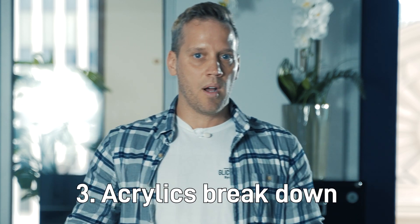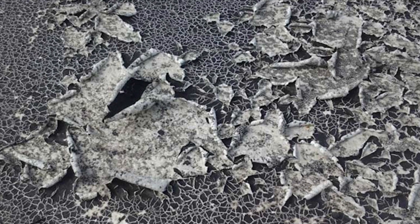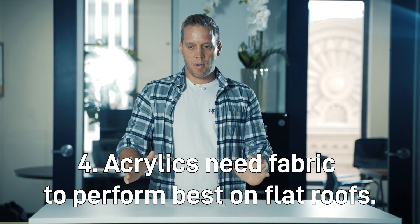Even on a large flat roof that's doing semi-well, whenever you look at your drains, they refill and water starts to back up. Now you have water sitting on the edge of the acrylic — wherever the acrylic stops, it starts eating away there, seeping back underneath and loosening it. Over a 10-year period, most of the system will eventually fail, so you have no chance of getting those 10 years out of it.